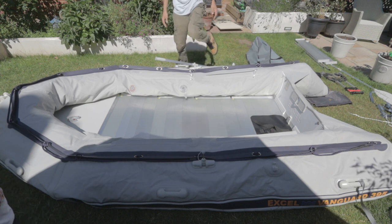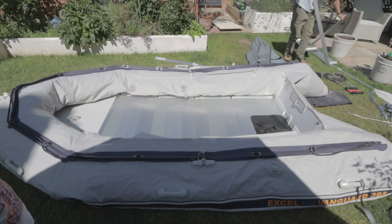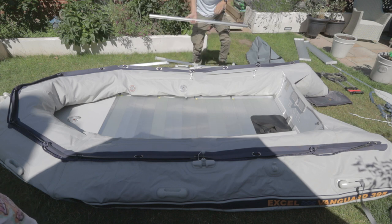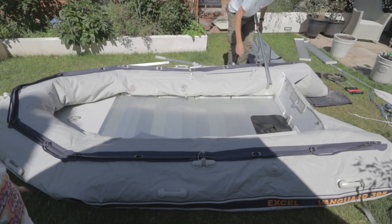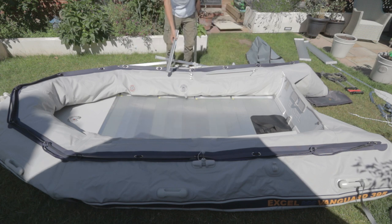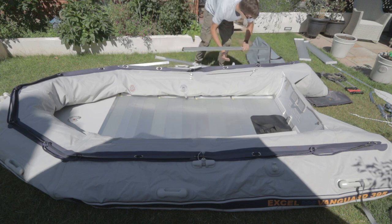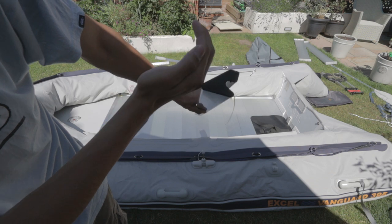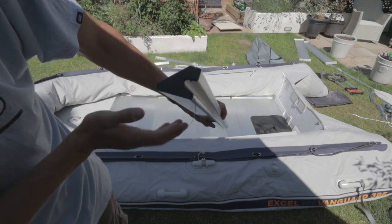So that's all nice. Obviously if you're standing on this the boards are going to creak and move — that's what these pegs are for. There's no particular side, but you don't want to go right up to the edge. There are some reinforced sheets of rubber here. Make sure there's enough room for the short one to cover this joint, and then the long ones are going to cover these two joints here. The cross-section points down — if you imagine this is the tube of the boat, you want it pointing into the tube, with that slot being where the floor goes, and the flat bits on the floor.